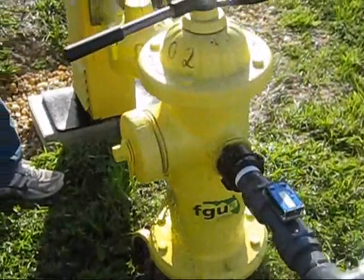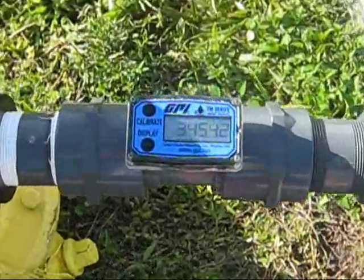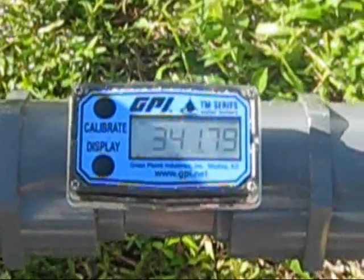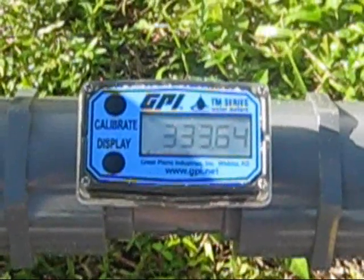Once a hydrant is shut down and the hoses are attached, the hydrant can be recharged for use. In the event a pre-scheduled flush program activates the HG6 attached to the hydrant being used to extinguish a fire, the flow rate from the remaining two connections will provide adequate fire flow volume.